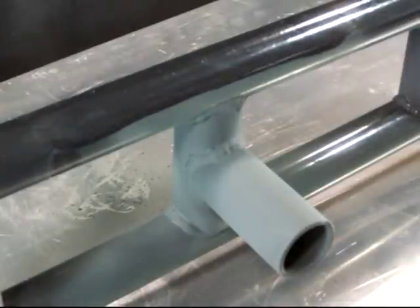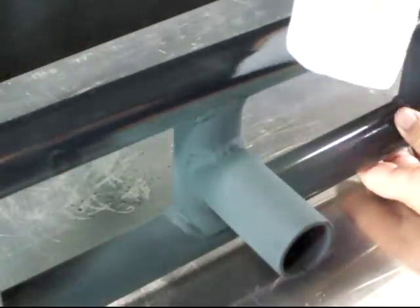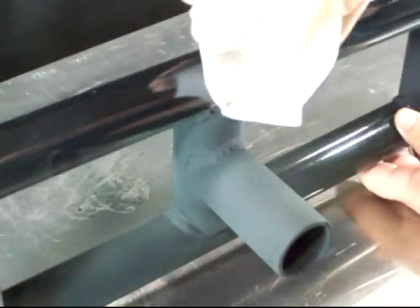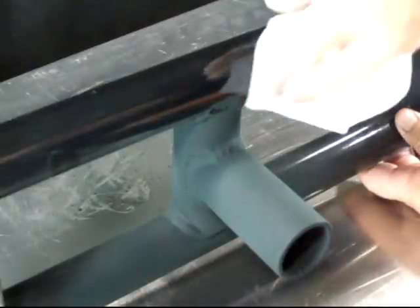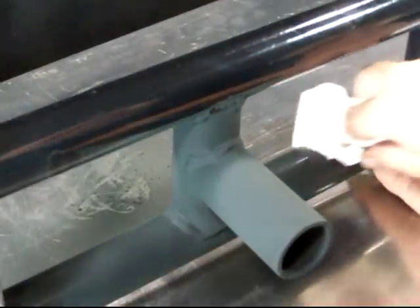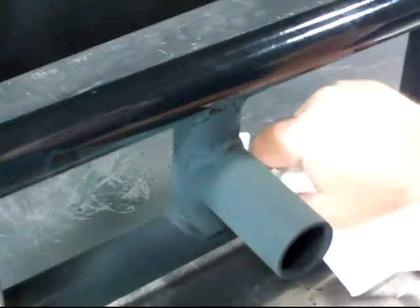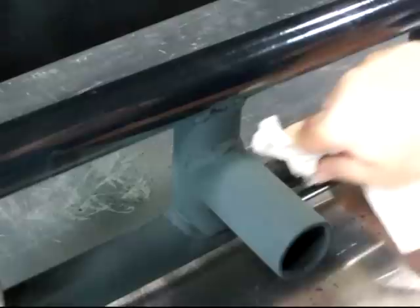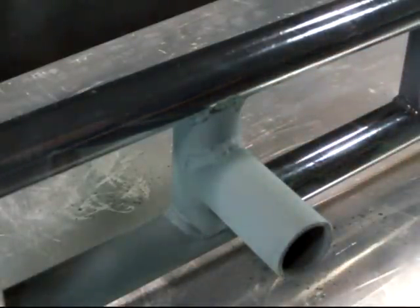Also, unlike the electrostatic process, the coating will not fall off if the part is suddenly shaken or bumped. So with practice, you can even gently smooth out runs or sags. If you spot an area you missed or it is too lightly coated, you can spray on more to cover it at this time. Then allow it to dry.